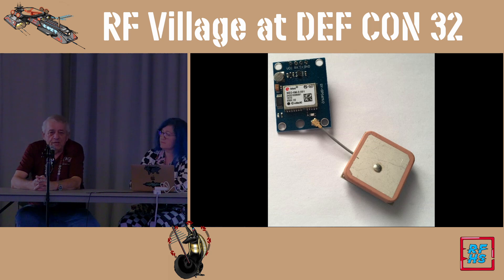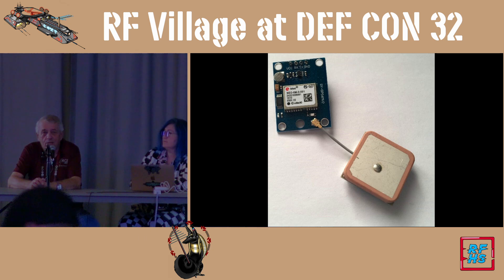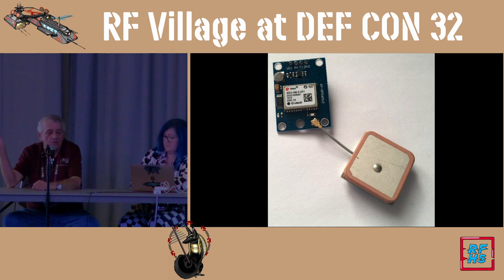We'll talk a bit about GPS jamming and spoofing. This is a simple little GPS receiver. The most sensitive part — the easiest thing to mess up — is that antenna. Underneath that antenna is a low-noise amplifier pulling three volts and a couple of milliamps; we're talking thousandths of a watt. You give this any strong signal and that amplifier saturates and stops working. Any strong signal will take out that LNA — that's the easiest way to make a GPS receiver stop working.